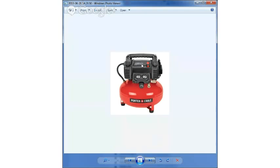Now, what they're saying with this 150 PSI is that the compressor just keeps chugging along until it gets to 150 PSI before it kicks out. What they're accomplishing is putting a little bit more air in that tank at a higher pressure, but it really works the compressor hard to do it. And these compressors are an oilless type, which are traditionally very, very noisy.